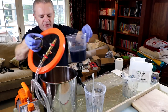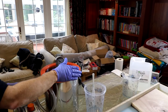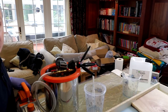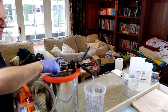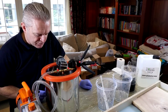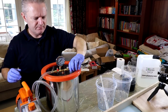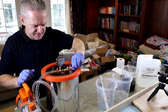Now we're going to de-gas. We get this pot sitting in my vacuum chamber — ensure that one's opened, pump on, hold that down. Vacuum starting. We'll wait for the vacuum to build and then we'll turn it off and wait for the gases to disappear. Lock that off and now we'll just wait. Okay, there's not many bubbles left now — there's a few, but I'm sure when I pour that will go. And if there's the odd one or two I can use a torch to just pop them. So let's release the vacuum slowly. And actually some of those remaining bubbles are now popping.